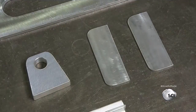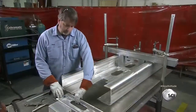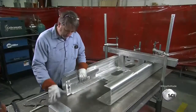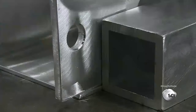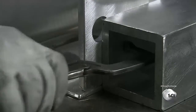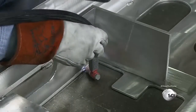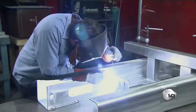They're now ready to assemble the hinges and other components to the plank framework. A worker positions a reinforcing bracket on the framework and clamps it to a hollow metal cube to keep it correctly aligned. He welds the bracket to the framework from the inside, then assembles another bracket to the other side.